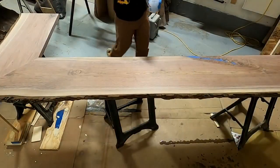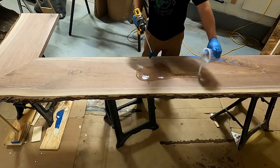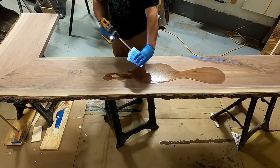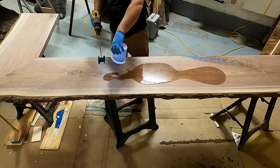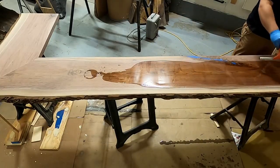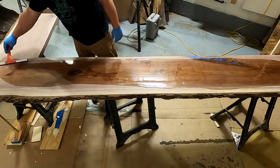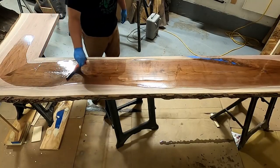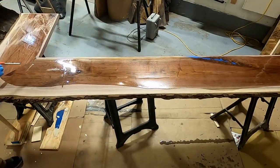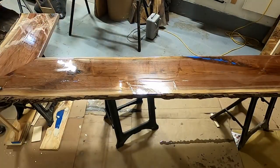This is where it becomes pretty obvious that you took your time and filled all these little voids to make sure that you didn't have places where epoxy is going to seep out. Seal coats are what make the difference between a glass-like epoxy finish on wood and one that's got a lot of dimples and bubbles in it. Some people, for whatever reason, just pour one coat of epoxy on top, stand there with a torch for hours on end, and still end up with some bubbles and divots in the final product. The difference between that and having a glass-like epoxy finish are the seal coats.